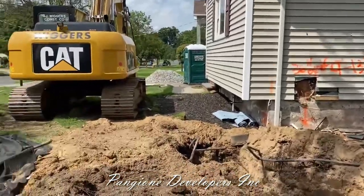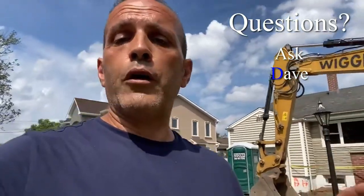Let's go in the back — we have two 1,000-gallon pits to take a look at. We just had the inspections, and that wraps up the installation of the seepage pits. Tomorrow we're going to excavate this home. The three additions include pier footings in the back, a garage footing here, and a dining room footing on the other side. For about three hours we're going to excavate and get things lined up, because two days later after the weekend the masonry crew will come in, set up the forms, get inspection, pour for the footings, and get our block work going.